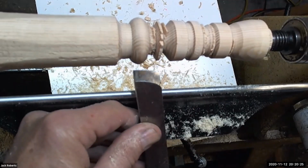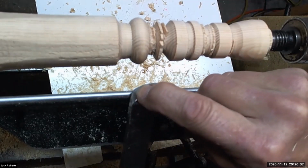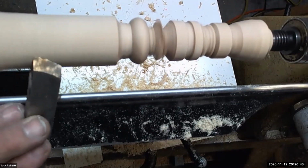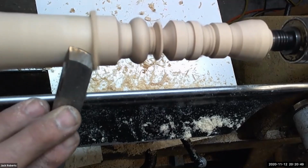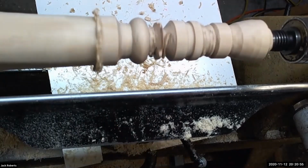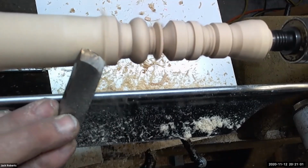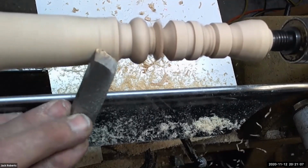For when you're rolling beads, you're leading with the heel. You're actually putting that point, the point of the heel, into the wood. Actually, it's not the heel. If you're doing a cut, it's actually off the heel. If you use the heel itself, Jason, if you stick the heel in here, here's what you're going to get. You're going to get, see it, push that wood forward. That pile of wood you're pushing forward. If you get off the heel a little bit, you see I'm not doing it now. It's cutting the wood off. If I bring it up on the heel, it's going to push it. If I back it off a little bit, it's going to cut it.